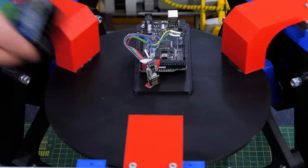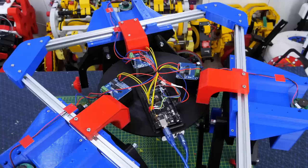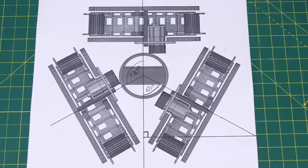Let's put some electronics in and see if we can get this up and running. I fitted a platform for the electronics which consists of an Arduino Mega with its radio chip and three BTS7960 motor drivers so we can control each of those three motors. I'm going to be using the Opendog 3 remote as usual to control this, and that's got another Arduino in with the other radio chip. The motors are 24 volts so I'm using a 6S LiPo to power everything.